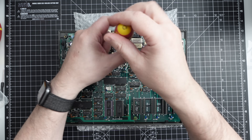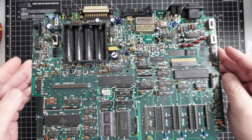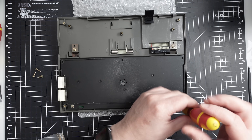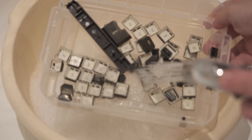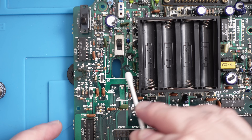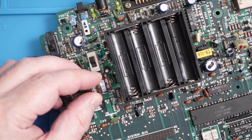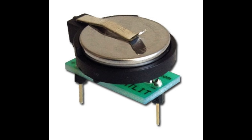Let's remove the motherboard to access the rest of the keyboard — only three screws, a couple of ribbon flat cables, and one more ribbon cable that connects the display. Now that the whole keyboard is out, we can remove the keycaps of the function keys and give all the keys and the case a very nice bath. This empty space is because some time ago I had to remove the battery — it was damaging the motherboard by leaking acid, it was too old. I got a temporary replacement with a battery of the same kind, but the best solution is to use a coin battery in a socket that includes a diode to prevent it from charging. That is a task for another day — for now let's use the temporary one.